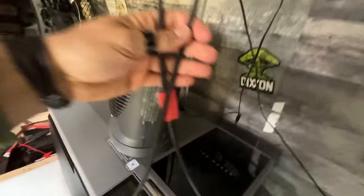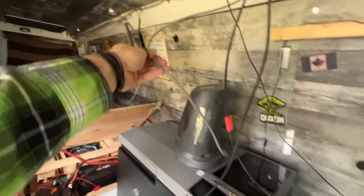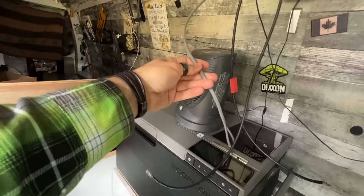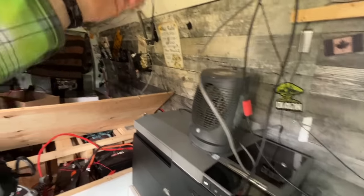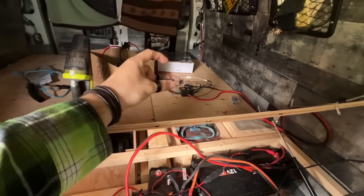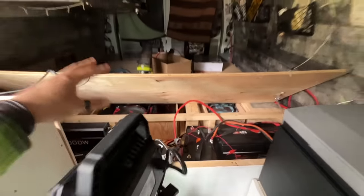We're going to have to trim a whole bunch of wires, right? We've got our two solar cables coming in here. They have to be extended to reach into the power box. This wire here is the wire to the fan in the rear. So it's maybe going to have to be trimmed up, not so sure, but it's going to have to run into the box, because I think what I'm going to do is take our fuse panel, which is right there, which used to live behind the driver's seat. I think I'm going to put it in here as well. So we gotta make this all neat and tidy, make sure we can get everything to fit.